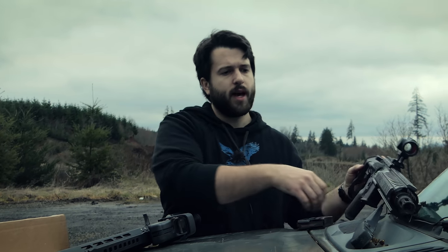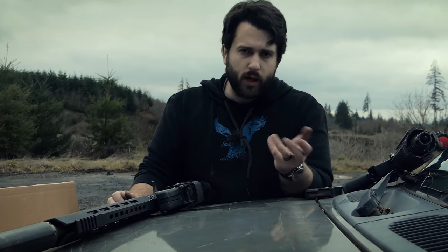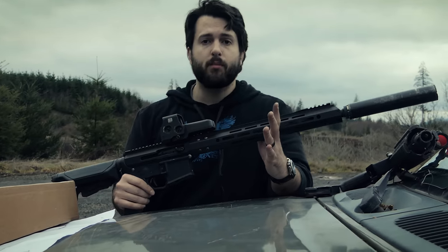The reason for that is when you're using a standard 7.62x39 bolt, you have to machine out a lot of it to get the case diameter, because the case diameter of a 7.62x39 is much thicker than a 5.56. So your bolt face is a lot weaker, which means that your bolt face itself could crack, but more likely that extractor, because there's a lot of material removed from an already pretty weak component on an AR-15, means you're probably going to be shearing off a lot of extractors, at least if you're into the very, very high round counts. Overall though, I am extremely impressed with the performance.